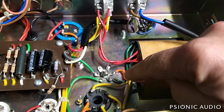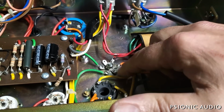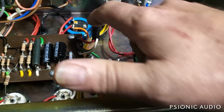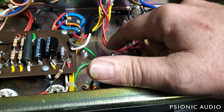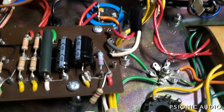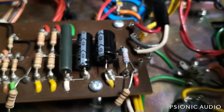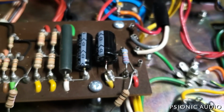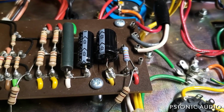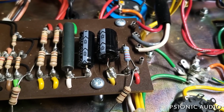It's using a lot of the same parts and construction as the TBX. That grounding there, I'm sure that can be improved. That's usually a big weakness in the TBX. This filter cap is not flush with the chassis like the others. Very crucial stuff to look at when you first get an amp in. You can see some leakage coming out of the output cathode bypass cap. So since that cap is leaking, I suspect many others may be.